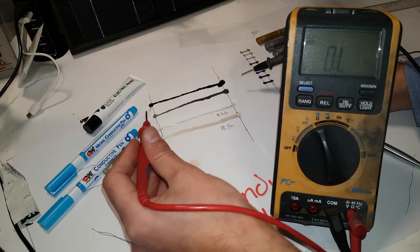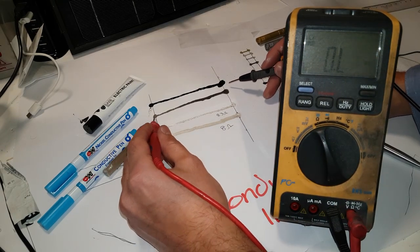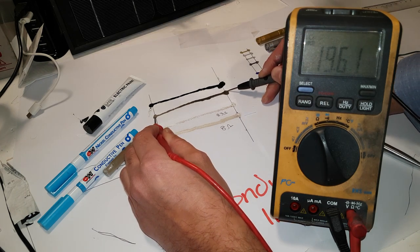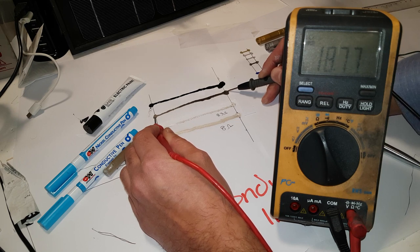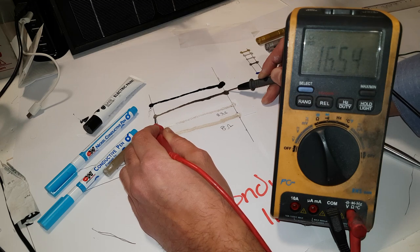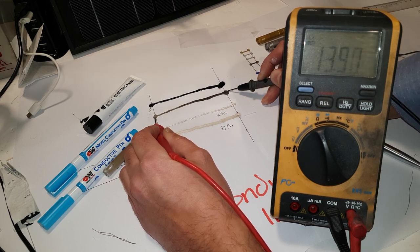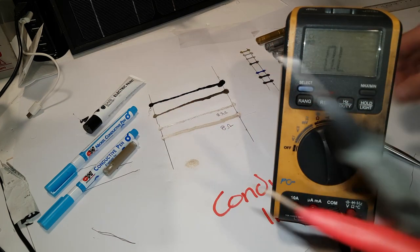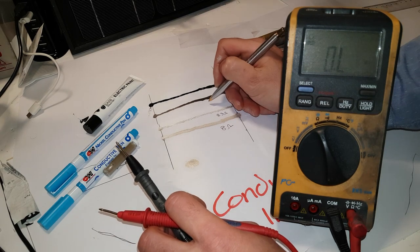This one is the nickel and I think this is still wet - I'll give it a go while it's still wet anyway. It's dropping as we're watching. It's either dropping because there's a current flowing through it making the resistance drop, or it could be because it's still drying and the particles are knitting together still. But at the moment it's 13.6k and falling. I'm going to write 13k there and we'll come back to that one.